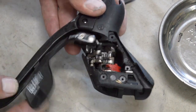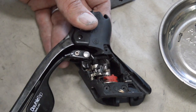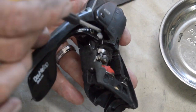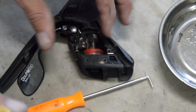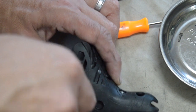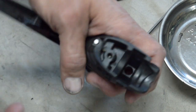If I would have just cleaned it up it probably would have worked substantially better. But now that we've got this apart we found a little issue with it. There's this other little screw on the other side — all that does is form a little overhang so the little rod that holds everything in place has a little keeper. You don't have to take this one all the way out — just give it a few turns, just enough to where you can't see it through that hole anymore.